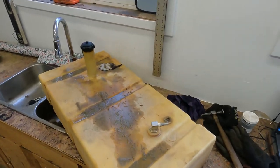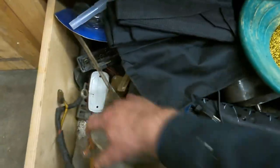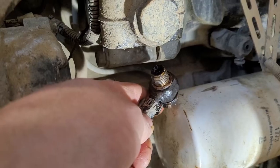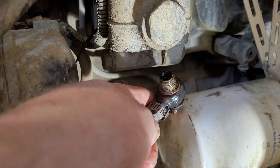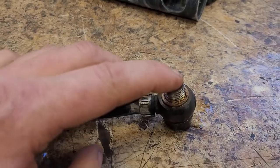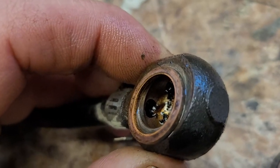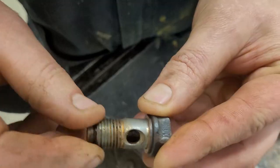Now that the mounting brackets have cooled down, I'm going to toss this thing back up. With the fuel tank back on, I need to check to see if I have about 3 feet of fuel line. With the banjo bolt off, I want to show you something that has occurred to me so many times on engines — these banjo bolts actually have a small screen inside of them. You can see that hole is almost completely clogged. So what do I do to cure that problem? I actually remove this screen and put an inline fuel filter. Look how dirty that thing is — it sucked itself in and was so clogged.